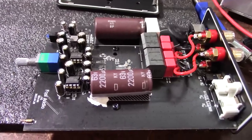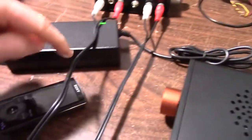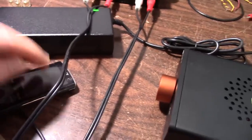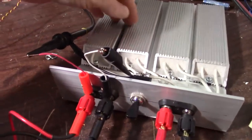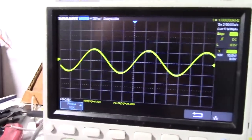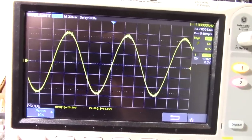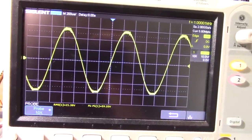I'm going to reassemble it and do a power test. Got everything hooked up. I'm using a signal preamp because these music players don't put out enough voltage even with the volume full open — my other player has a true line out voltage level. I also have a non-inductive load bank switchable between 8 and 4 ohms, and the scope connected. And there's clipping — you get a little bit of fuzz at the top and bottom, pretty typical of these Class D amps.